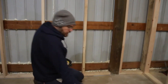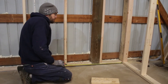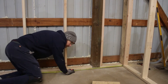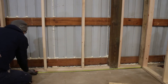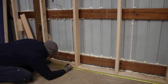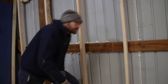Here it is in action. You have to pick a fixed point — I've actually tacked a screw right there so that point can't move. Since this is a 10-foot wall and this is a 12-foot wall, I'm going to go the long way and make this measurement my eight feet. There it is — eight foot.